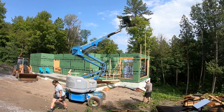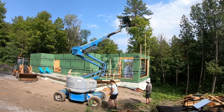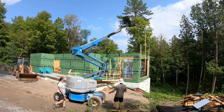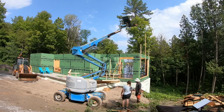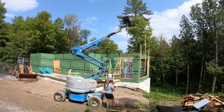Larry is still very new to us, and so we are learning his functions and overall total reach. We even pull out a tape measure and verify his reach compared to the spec sheet. We determined that we need to move Larry closer to the house in order to have the reach that we need in order to set the trusses into position.